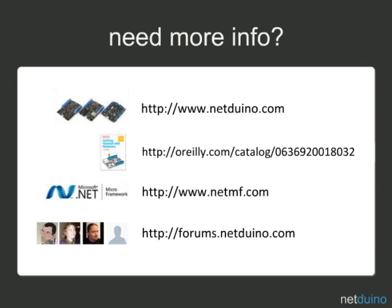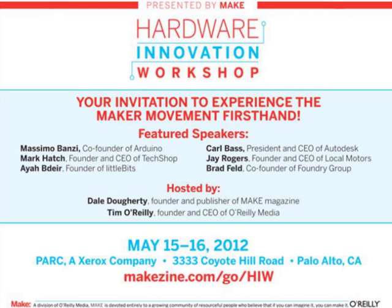So the answer to that is very fast. It's in the megahertz range, and on some of these microcontrollers, it's almost as fast as the microcontroller itself is. And the nice thing about interrupts on hardware pins is that generally they happen in the background. So when a signal comes in on a hardware pin for an interrupt, you're not actually using code to poll those and see what's going on. It happens in the background. It gets queued up. It gets raised in your code. And yes, it does get raised on an event. You can do that in a multi-threaded environment so that they're not blocking.